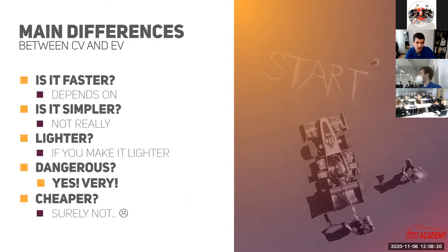Yes, an electrical car is very, very dangerous, especially because the dangers are invisible. Obviously there is a risk of electrical shock because you are dealing with high voltage systems of up to 600 volts, and DC voltage and DC current shock is much more dangerous than AC. You have to be very careful not just with the battery but with the electrical motors and the inverter as well, because the inverter usually has bulk DC capacitors which store energy and do not discharge immediately when you disconnect or switch off your system. Make sure everything is de-energized and discharged before any maintenance on the high voltage parts.